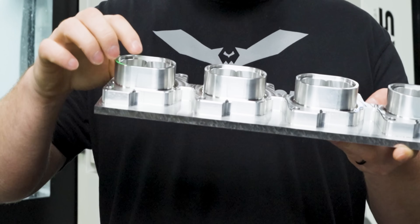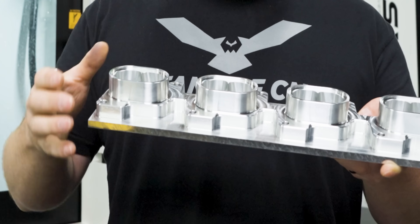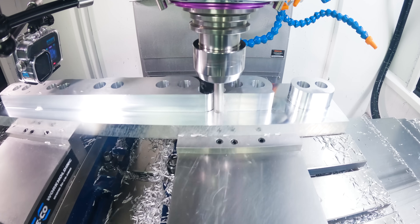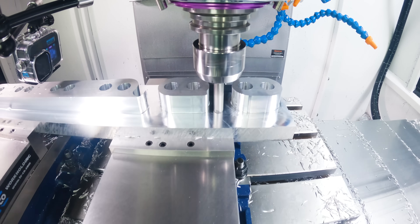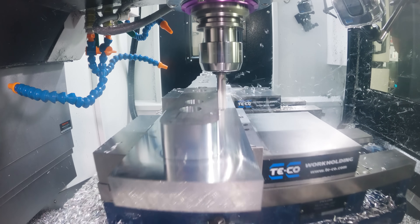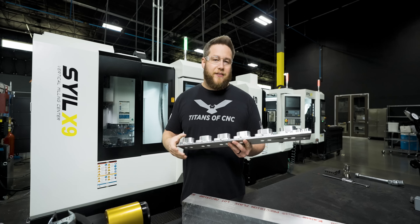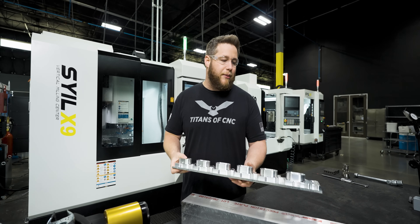Same thing when it steps up to this top little counter bore — for the counter bore and the material left on top of the part I'm going at about 100 thou step-over, increasing it because I'm not cutting with as much of the flute. My original thought was it would take longer doing this in two steps, but since I was able to increase my step-over and feed rate, I actually cut three, four, or five minutes off this cycle time compared to just dropping full depth and working my way to the top. Not a huge savings, but if we were making a hundred of these it would really add up.